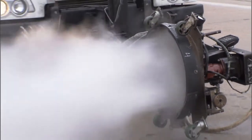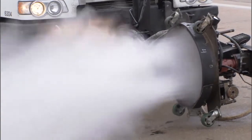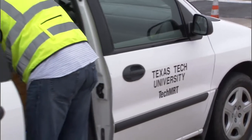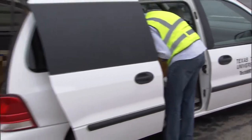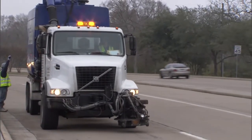What this process does: it uses ultra high pressure water at about 33,000 PSI and it cuts the asphalt and vacuums the asphalt off the road to improve the texture. Five years ago we had a research project that Texas Tech did for TxDOT to look at how to treat bleeding and flushing sealcoats, and one of the recommendations from the research project was to hydroblast the asphalt off the road.